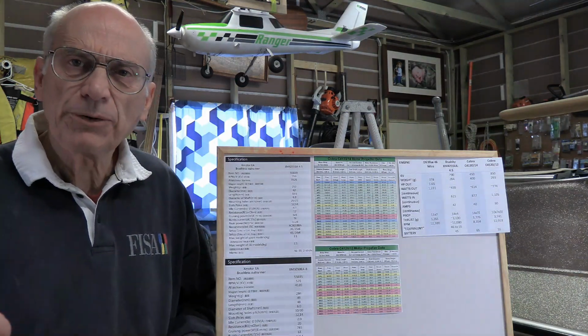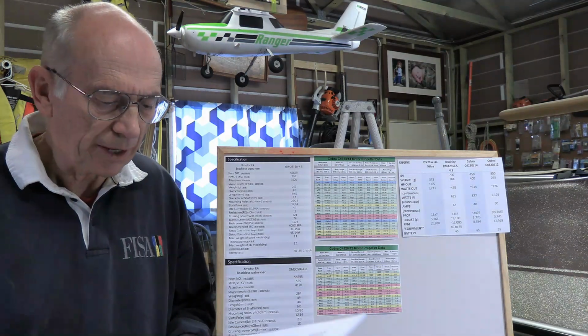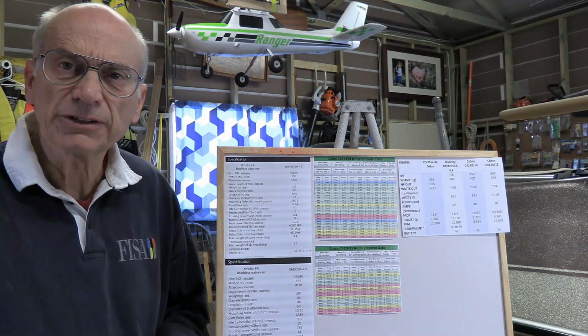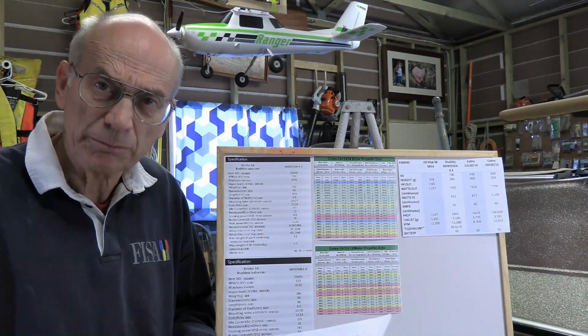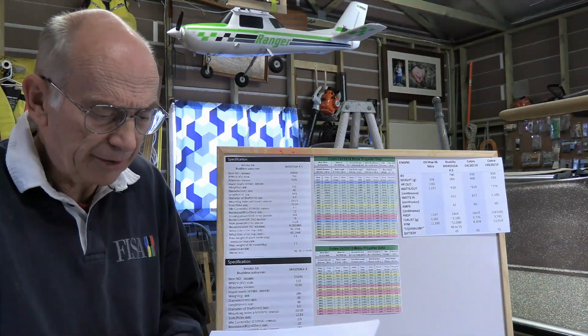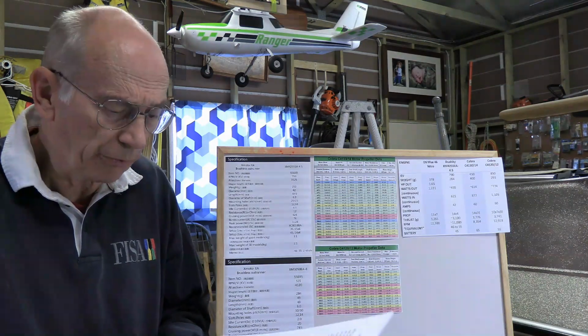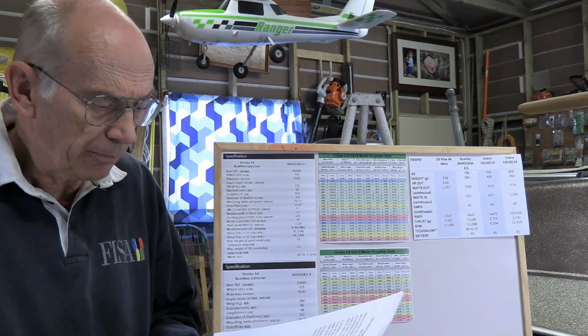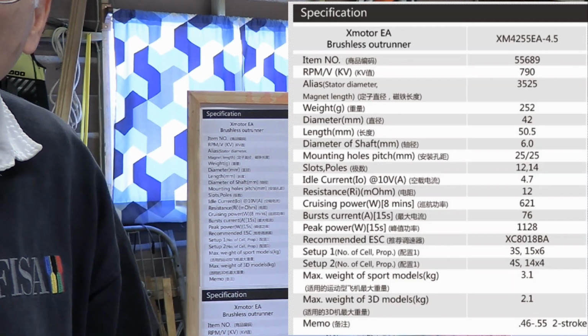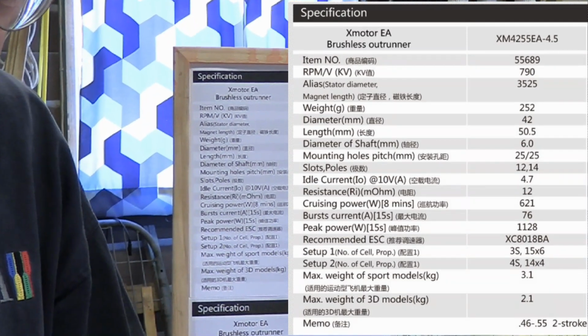So the power going into an electric motor is going to be much greater than the actual power it delivers to the prop. I've done a bit of research on this and looked at people that have tested them, and they reckon that around 60 to 80% efficiency would be common. So if we work on a 70% efficiency, then even taking an OS Max 40 with 1.35 horsepower, we end up requiring 1,438 watts, or 1.4 kilowatts, input into the electric motor.